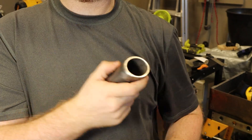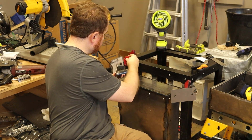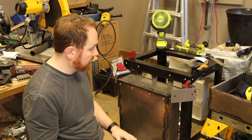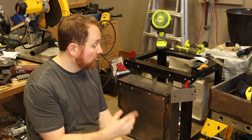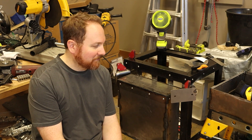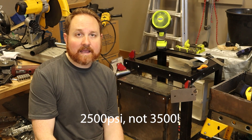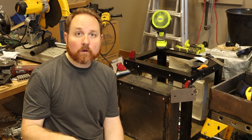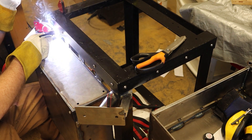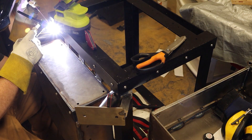The fit on these is absolutely perfect — I literally couldn't get any better. I can hold it with a magnet and it's great. Now I'm going to weld this up with the TIG welder. I'm not sure I'll get all of it done because I'm almost out of argon — I've got about 200 PSI left out of 3,500 that you start with. So I'll probably just get these tacked in, and tomorrow I'll get more argon and finalize the welds. I'm welding each one securely so I don't accidentally knock them off.